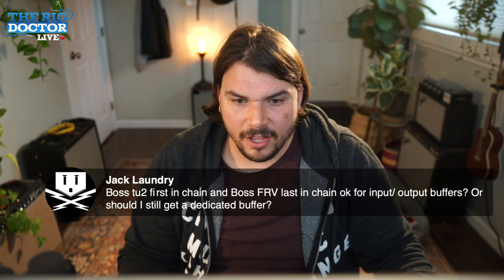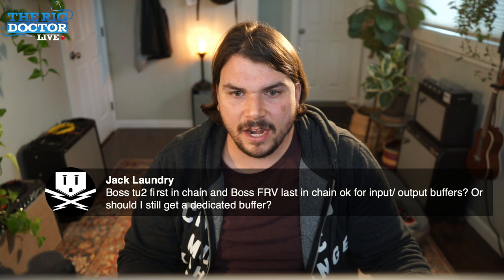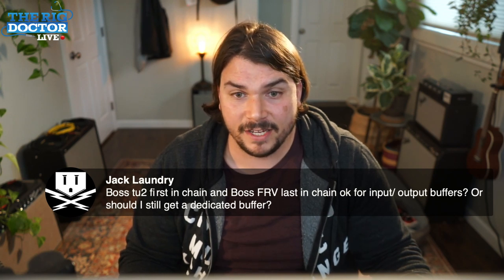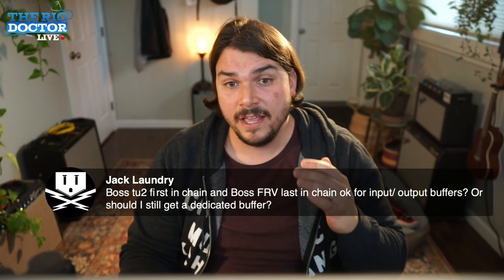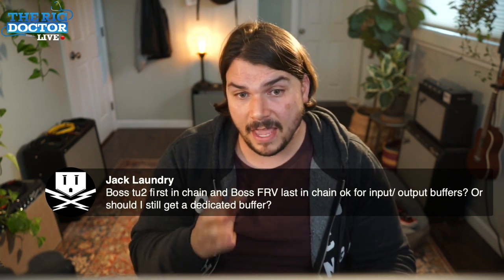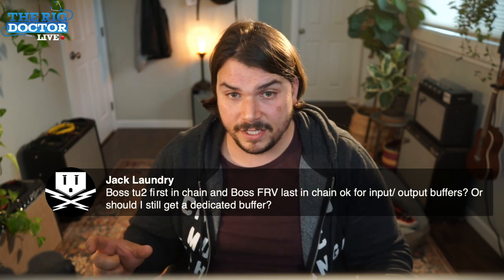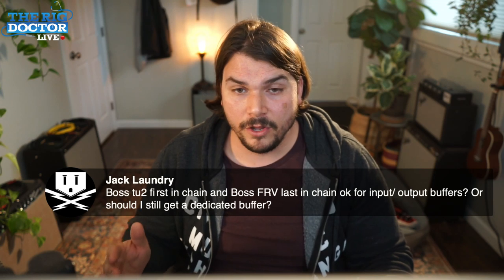This is from Jack Laundry. Cool name. Boss TU2 first in the chain and a Boss FRV last in the chain. Okay for input and output buffers, or should I get a dedicated buffer? Yes, you should. So when I talked about buffer specs, Boss pedals actually typically aren't just one buffer. So when you're talking about the FRV, you're talking about the TU2. Sometimes there's actually multiple buffers inside of Boss pedals.